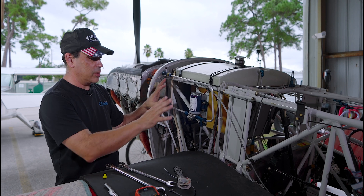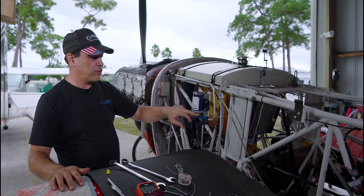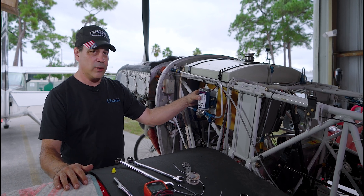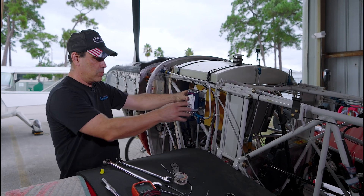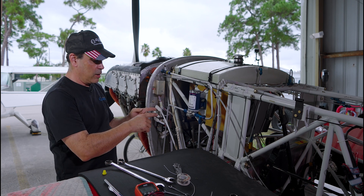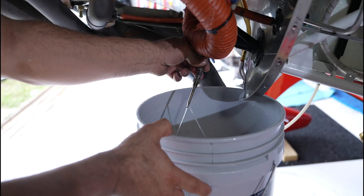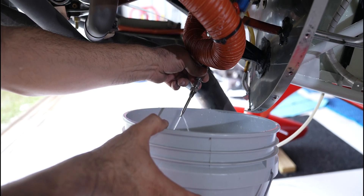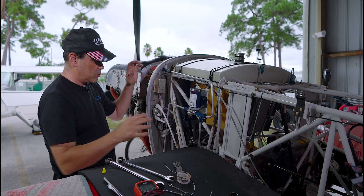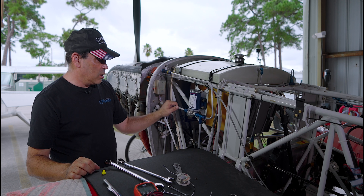Pretty much everything is done on this side. Warren's putting torque stripes on all these fittings and double-checking everything. We just tested the system — we ran a whole bunch of water, pulled it up through the filter here into the motor, filled up the whole system. It turned off automatically because of the float switch — that was perfect. Then we went in the other direction, put the switch on at the throttle, filled the bucket, and made sure the system worked. We ran the whole system out — no leaks. We did a full leak check on everything here. All the wires are just being fine-tuned right now.